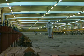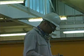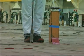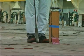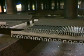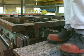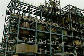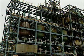The cell works most effectively when the distance between the titanium anodes and the mercury cathode is about three millimetres. The plant operator is adjusting the anodes — he can raise or lower the titanium plates. This is what is happening inside the flowing mercury cathode cell. Used brine is treated to remove traces of mercury and put into the river estuary.